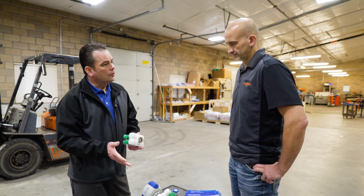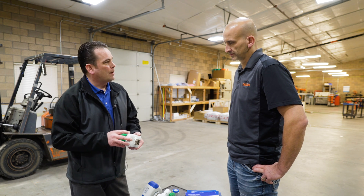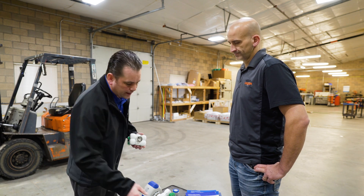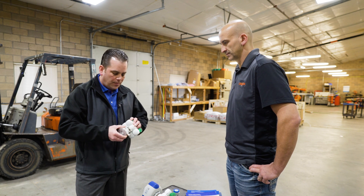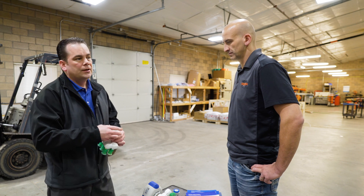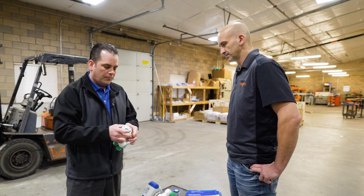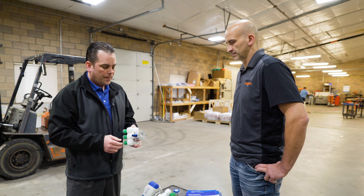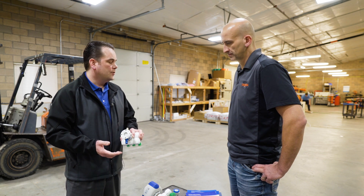For smaller robotic applications, our VEE gripper assembly is a really nice product because it's very expandable. This is our vacuum generator module, which would adapt directly to your smaller six-axis or collaborative robot. We have all the different flanges available for it. Supply compressed air and you can use one of the auxiliary ports for a blow-off feature if you need to.